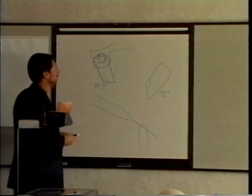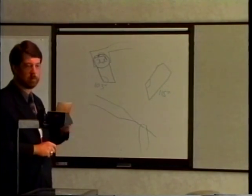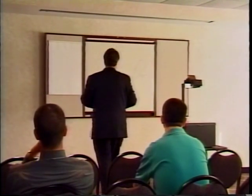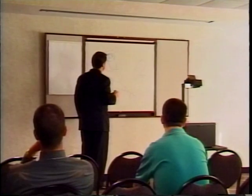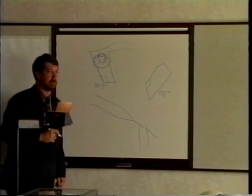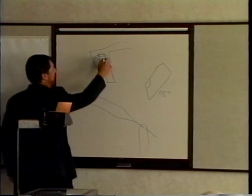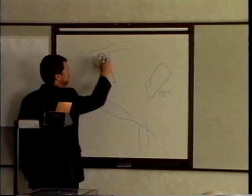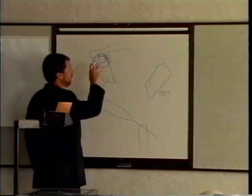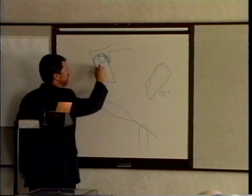If you're going to epoxy something and you have zero clearance, just enough to slide, you're not going to get full adhesion. But no one ever mentions that relative to pallets. Okay, well, let me see if I can put this. You have to have space for the adhesive to be in. Yeah, but really the only space that you're going to have once the stone is pushed up into the slot is this taper and this part right here. Most of your adhesion comes from the amount of shellac that is on top of the stone and overlaps onto the frame of the pallet.